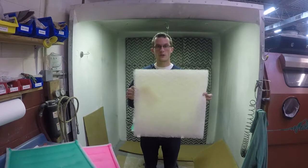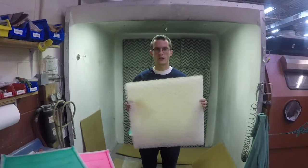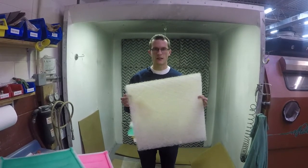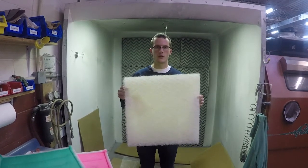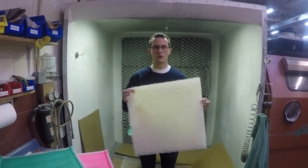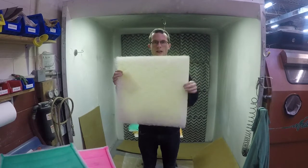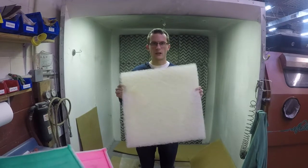If you want to look at an option for cost savings and time efficiency, you could go with a blanket style filter. You get those in 300-foot rolls for anywhere from $230 to $280 depending on the width of the roll. Often for a 3 or 4 foot wide blanket, you'd be able to change out your entire booth a multitude of times before you would replace that roll. That can be used with a quick lock system, which essentially grabs the top of the filter, and then the filter hangs down from the ceiling to the floor, allowing you to quickly change it. And because you're buying in a large bulk roll, you'd have some savings there.